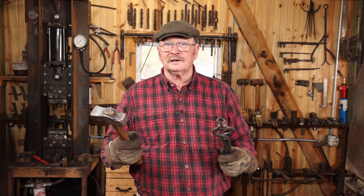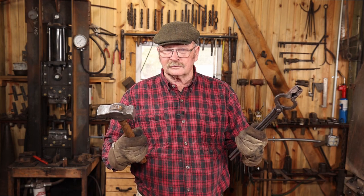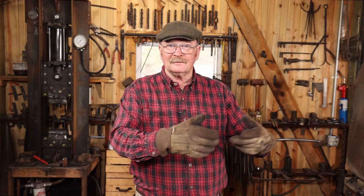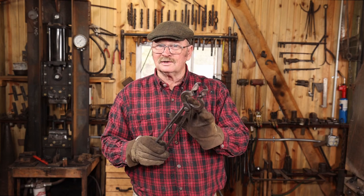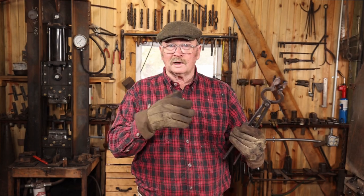So they aren't ideal — all of these things are trade-offs. The gloves with the best dexterity are the most likely to burn you, and the gloves that are least likely to burn you offer the worst dexterity. So if I don't need gloves, I tend to avoid them — more likely to wear one on my tong hand than on my hammer hand. But working at the power hammer, I'll usually wear both of these Kevlar gloves. One, I'm usually coming out of the gas forge and it's hot with a flame front. I don't want to get my hands that close. I usually have both hands on the tongs, and it's a lot easier to control with two hands, so the slippery issue isn't so much of a deal. And they help absorb some of the vibrations from the hammer.